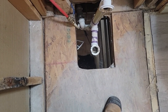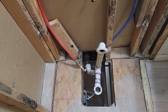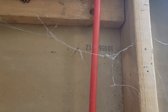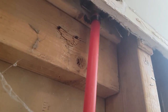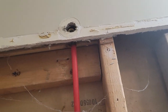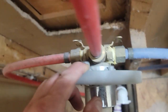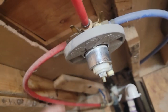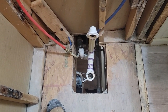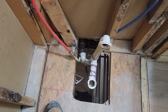It might be possible to cut the pipe down below and do a reducer, because a two inch shower drain to an inch and a quarter pipe isn't going to meet code anyway. The shower head — I might change that out, it moves a little bit, yeah it moves. So find out if the ear's loose on that or replace it. And then this has PEX crimped fittings — female. I don't know if they're reusable or not. I want to replace the shutoff valves because they don't shut off all the way.